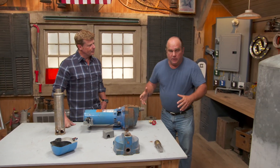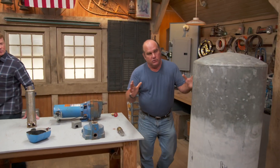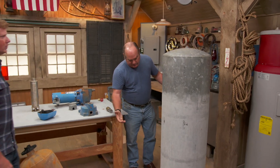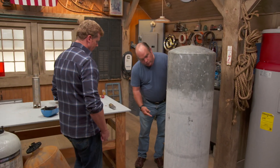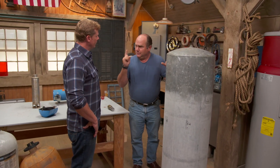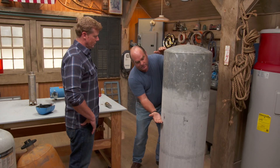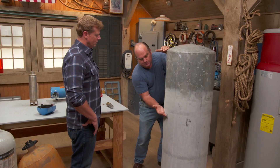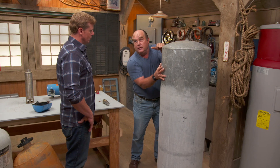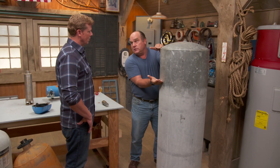So to get around that pump coming on and off, we've been chasing it for years. In the earliest days, you'd have a galvanized tank like this. You look at a tank like this and say it must be that the pump pushes water in here and it just comes out through the top. But you're really using this tank to store some water and to compress air. You fill it up — here's air — and the water comes up here, pushing this air and building up the pressure. So now it would shut off at 50 or 60 pounds of pressure.